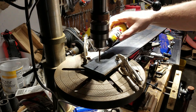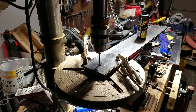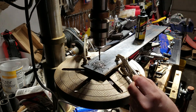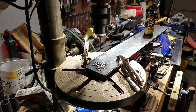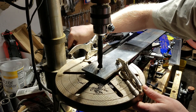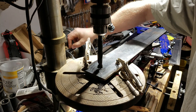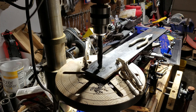Probably not a bad speed — a little bit of lube on there and off we go. Nice firm consistent pressure. Just bring the drill up to meet it, and I think we're around there. Had to release this to use the winder on the back to raise things up, and now we're going to clamp the whole thing in place.